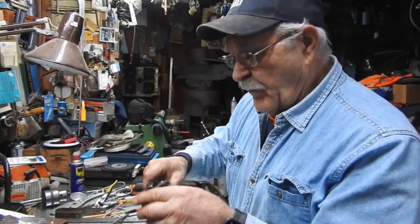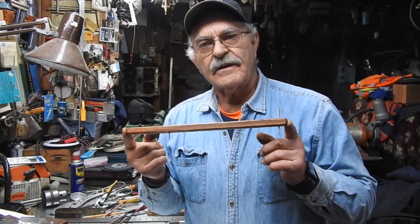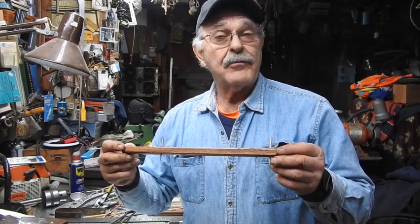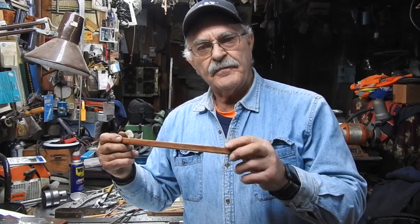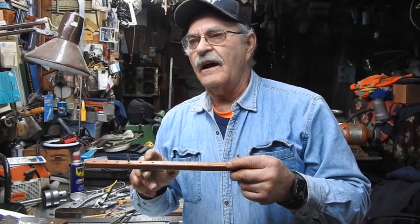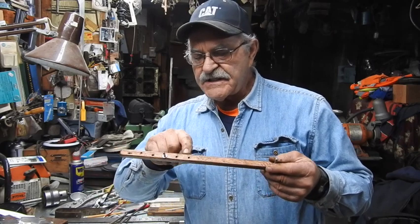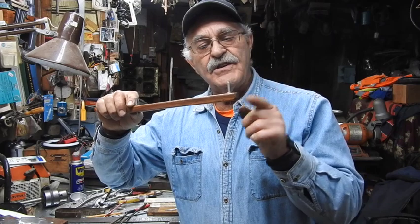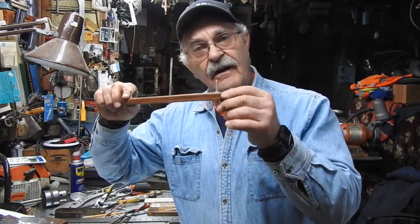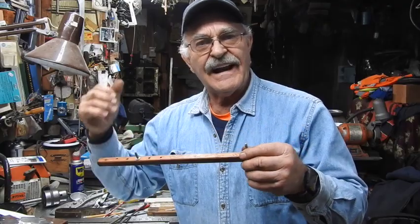This is another viable option for marking a stair-step full of flat ducts. However, what I like to do — because this is much shorter — is just take a piece of half-inch or three-quarter-inch scrap wood, measure one point in from the end at a convenient distance, and stick a pop rivet down through there. Then come out here and measure: for a standard 7-inch duct you want an 8-inch hole, 8-inch duct make a 9-inch hole, 10-inch duct etc. You can see a series of holes drilled in here. This is set for 9 inches, which is for an 8-inch duct. You just rest this homemade trammel point right against the outside edge of your duct and use the other point to make your mark. Much simpler, much quicker, much easier — and it doesn't cost anything. If you lose it, you just make another one.